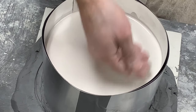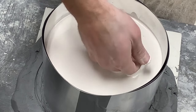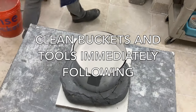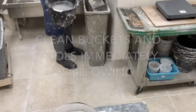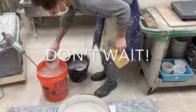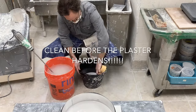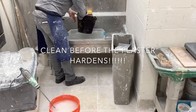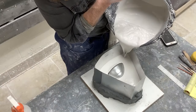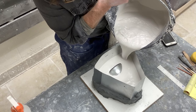Use the back of your hand to break the surface tension while the plaster is wet — this makes the top flat and ensures it's filling all the corners. After pouring, dispose of any extra plaster into an old box or trash. Use rinse water in the rinse bucket to clean your bucket and tools, then give them a second rinse at the sink. This is an example of waiting too long — you can see how chunky the plaster becomes.